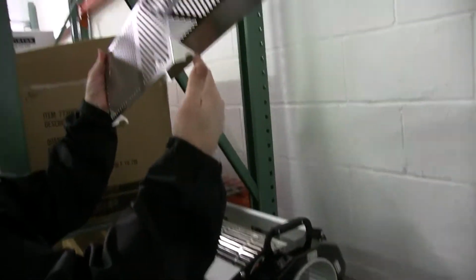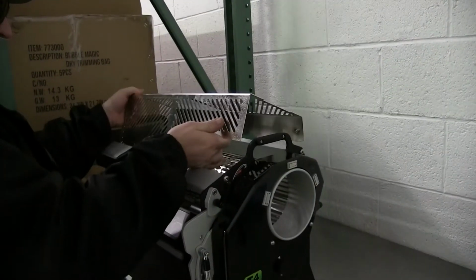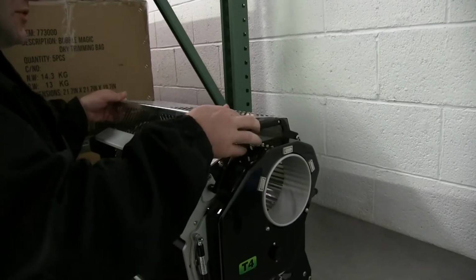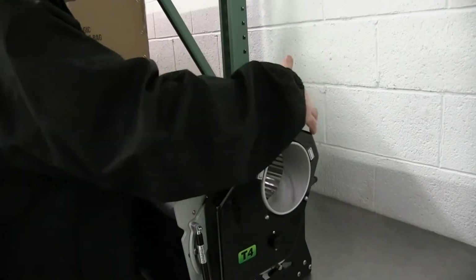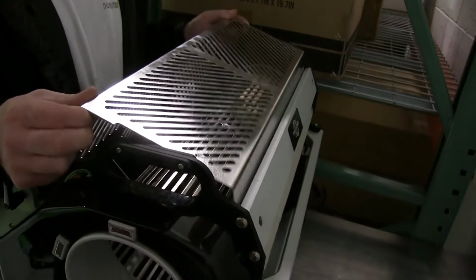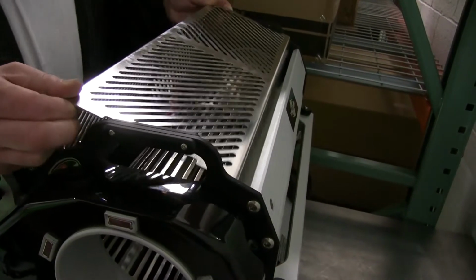This one you want to make sure you don't just jam it in there, because it's got these things that can damage your tumbler. Defeat the purpose of your tumbler guard. If you look, it goes on the inside here. So not on the outside of this bar, but this thing goes on the inside, and you kind of just got to slide it around these handles. You see how when I go like that, it just kind of falls in there?